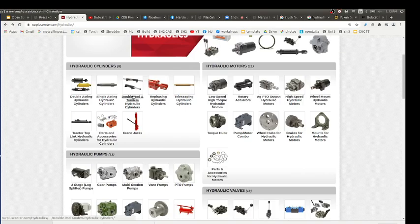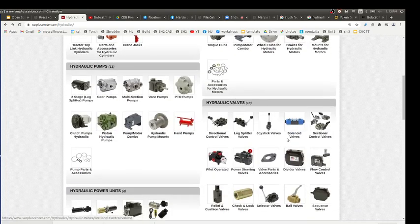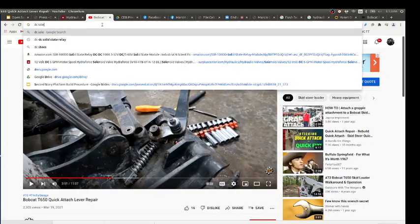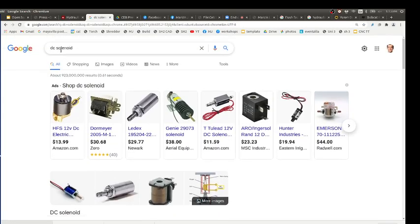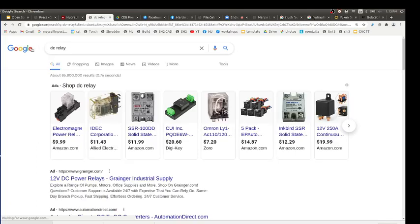So in terms of, if we want to do electronic control on the CV or something like that, do we have to do a step up, like a 5-volt DC relay that then triggers the 12-volt solenoid, and we have a separate 12-volt power supply? I guess you could do that, because you have a 12-volt battery out there, so you can run that. Yeah, exactly. So my real question is, are there DC hydraulic solenoids that can be triggered by 5 volts directly from our universal controller?